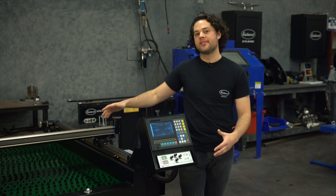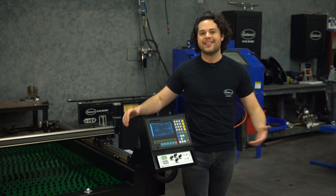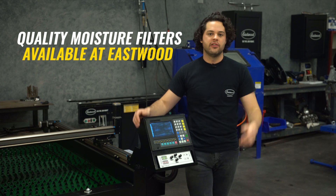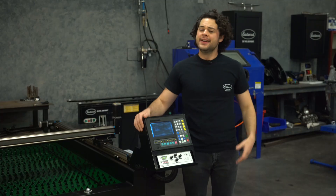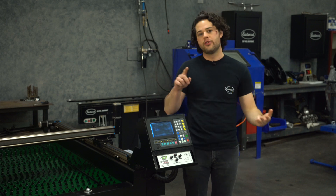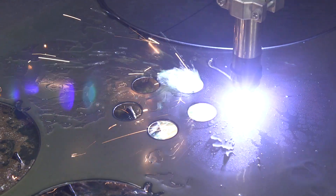We do give you all the big things, but you'll need some basics as well. You're going to need a compressor — this machine requires five to seven CFM at 60 PSI, which really isn't anything crazy. We also recommend a good moisture filter because, like any plasma cutter, you want your air as dry as possible. You're going to need a 240-volt power outlet with a 50-amp breaker, and lastly some plasma cutting fluid additive and whatever software you use to get your files onto a flash drive — SolidWorks, Fusion 360, whatever. But really: compressor, moisture filter, 240-volt outlet, plasma cutting additive, and software — that's it. Pretty standard stuff.